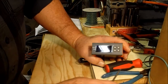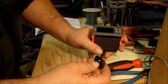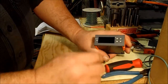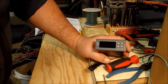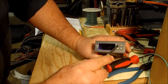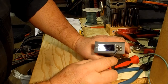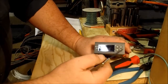Push the set button once and it shows the display temperature the probe is indicating. The probe has a couple feet of line — that's the temperature probe. When it comes on it shows the standby reading, which is the default. To set the working temperature you push the set button, then use the up and down buttons to change your setting.